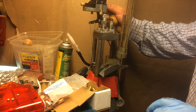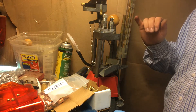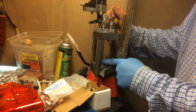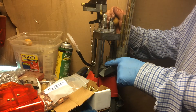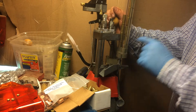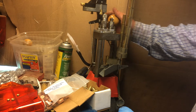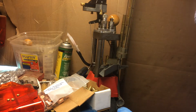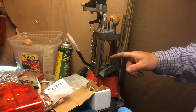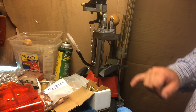I do have it tuned in now. I made a couple modifications — the first thing I had to do is this center stud, which is threaded and the shell plate threads onto it. There just was not enough clearance; that thing was bound up tighter than you could imagine, there's no way it could rotate, especially with the plastic gear. So I made a little modification, gave it a few thousandths gap, and it's working now.